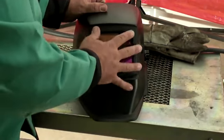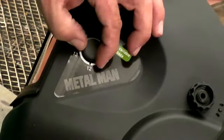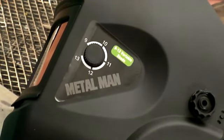This viewing area stays in a 3.5 light state when not welding. This means you can have your helmet down and protecting you even while you position your weld project and get ready to weld. The lens protects you up to shade 16 from ultraviolet and infrared rays regardless of your shade setting. You can change the shade setting from 9 to 13 for better vision and maximum protection.